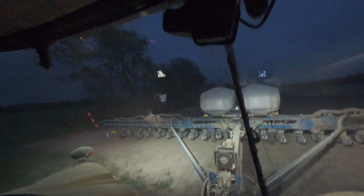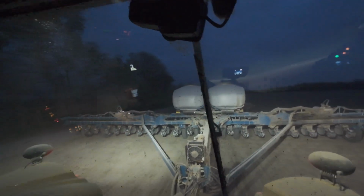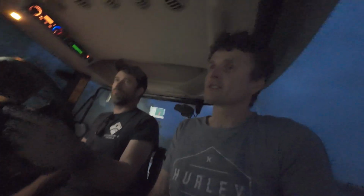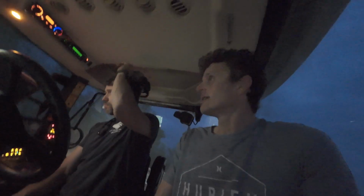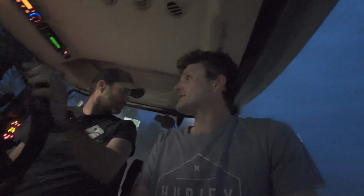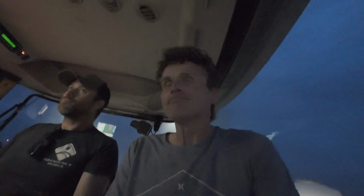If we get rain, we're gonna have a cylinder off, that's for sure. Yeah, I want to try rebuilding that one. I think that'll fix it. For the barrel-less cylinder, as long as that's not scored, it can be rebuilt. We've had this on another Kinze, the 3800, we had some cylinder issues. And on the 3800, I actually welded on one of the cylinders, welded the end back on the barrel. And that always held, but the hydraulics maybe could be a little better, I guess.